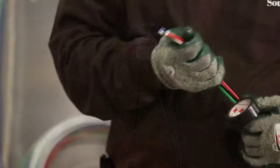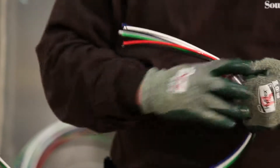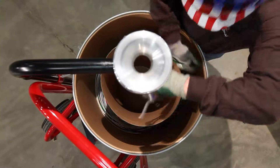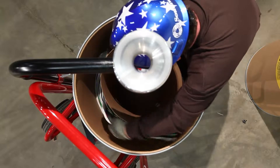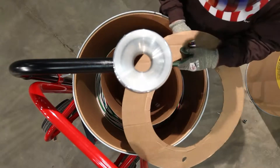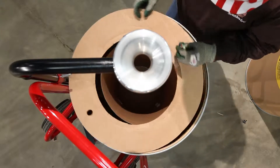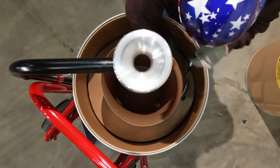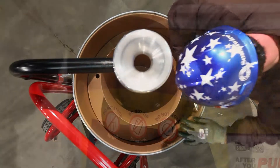When it's time to clean up, ensure the parallel end is taped. Coil the parallel conductors back into the container through the wire guide ring, using one hand to wrap the coil around the center core and the opposite hand to provide tension so that the wires are neatly stacked back into the container. If possible, replace the interior cover and pull the wires back through the holes on the interior cover and barrel container for optimal storage.